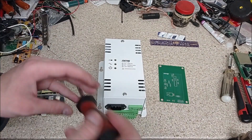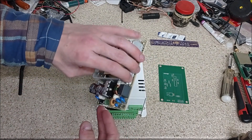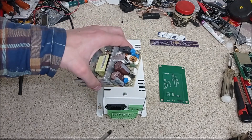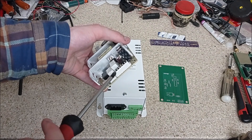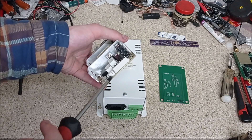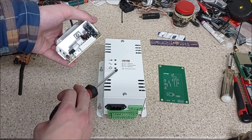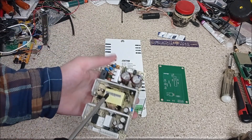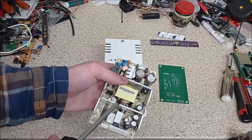Let's take a quick look inside. This is the actual power supply that goes in one of these — I have quite a few of these kicking around. What's special about it is you have your 12 volt output, your battery input, and also two relay contacts. Those are what tell me if the mains coming in is okay or the battery is flat. All of that comes from this board, so you don't actually need to know any programming to build this.